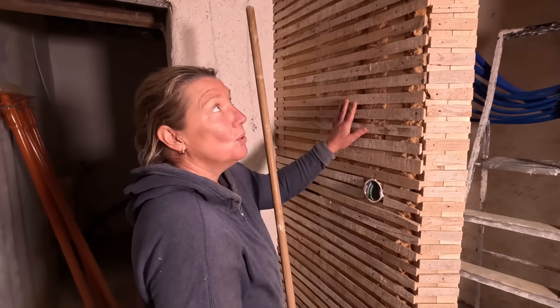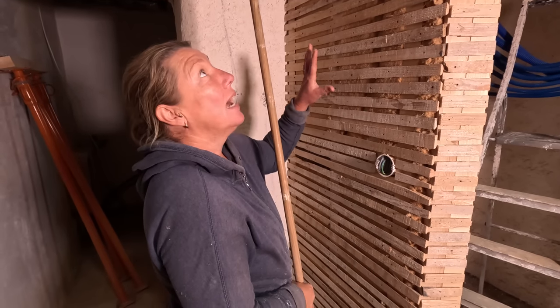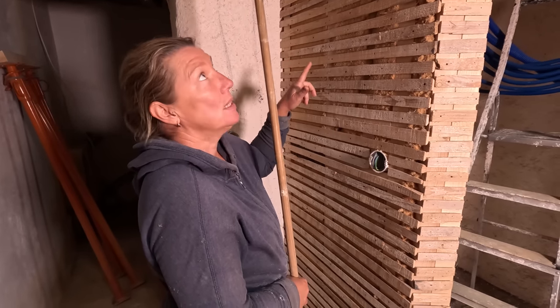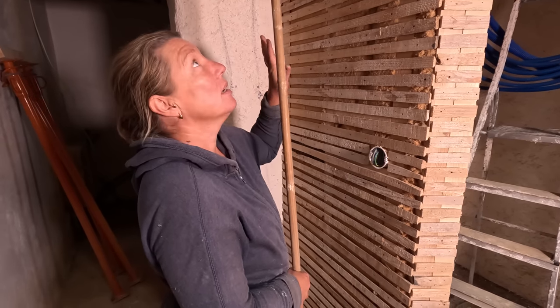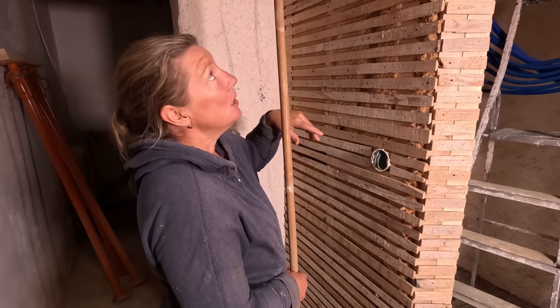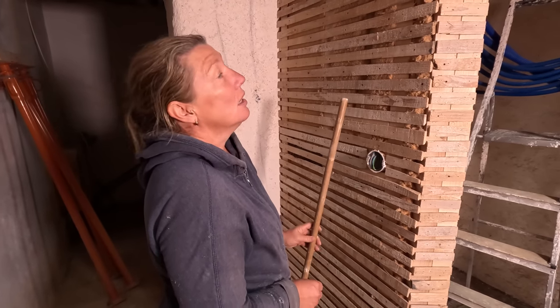Because we had this wall already here, we didn't want to take it down and rebuild it. And the joist material that we're using is much taller than the original joists. And so when we realized that that would make the floor way too high, we were like, oh, well, we'll just take a notch out. And we notched out from the beams. And that's not good, because... We've essentially weakened the beams.